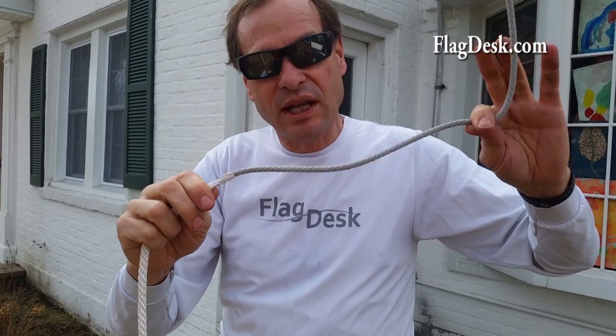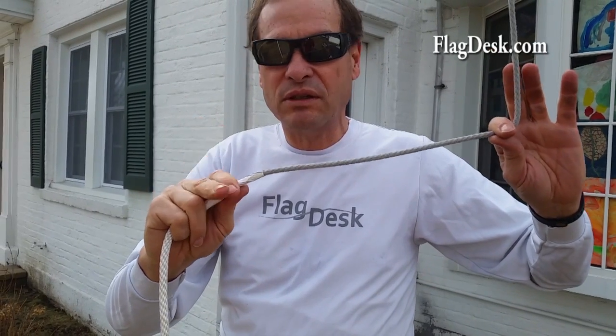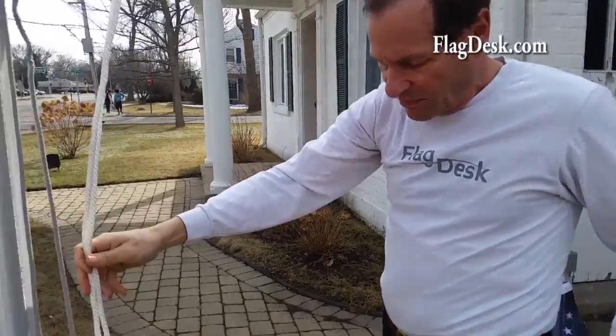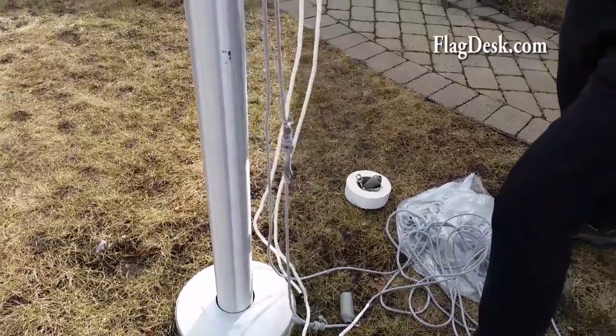We just think the PHA is a little light for this flagpole with a five-by-eight U.S. flag — it's really stretched it out and taken a beating over a year and nine months. So just think about your halyard: if you don't use wire center, after about two years you're probably going to need to change it out. When changing the halyard, just pull it up and through — no problem. You want both ends to be down to the ground.